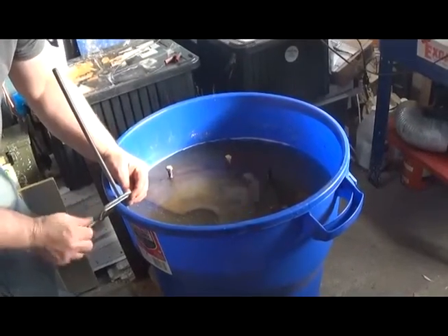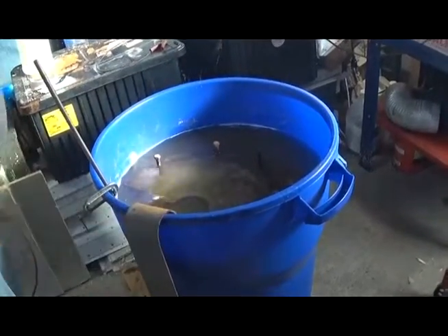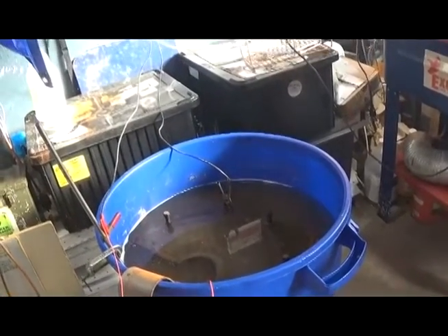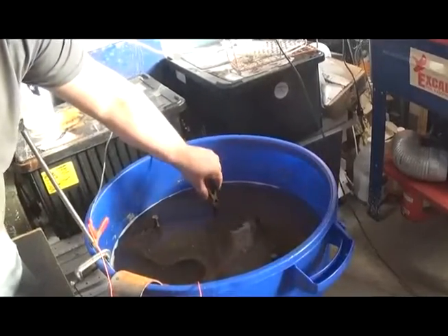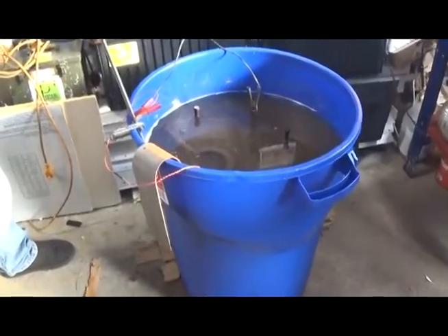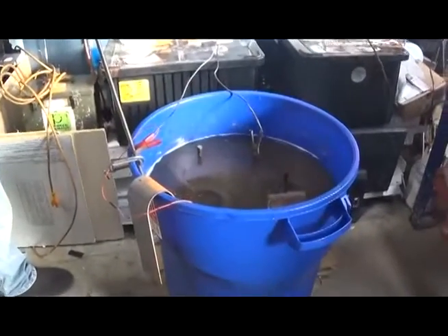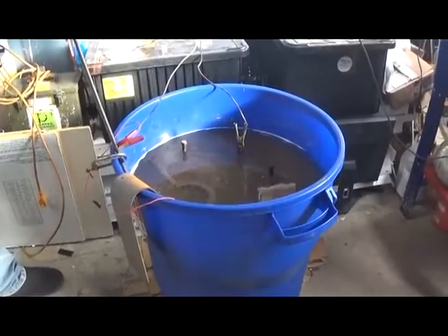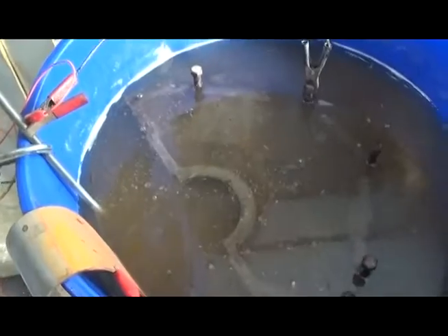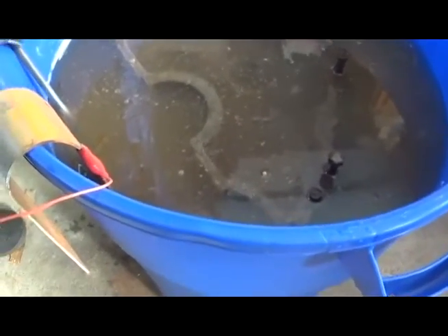You don't want to just tip it over. Pegged it. It scared me — I know it. I'm trying to kill it. This rod was touching the bottom of the... I see, there must have been enough crud down there that shorted it up. It's going to take long though, so we'll leave it in the soup a couple more days. Just look at it sitting there and souping up — look how fast that starts to work. Man, it must be mad. Chemistry. Chemistry at work. Taking off bad, nasty iron oxide molecules.